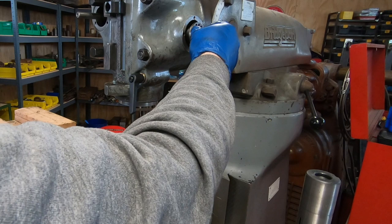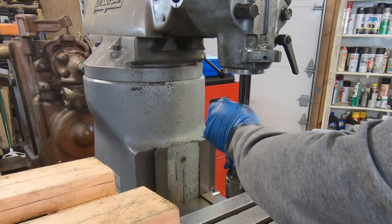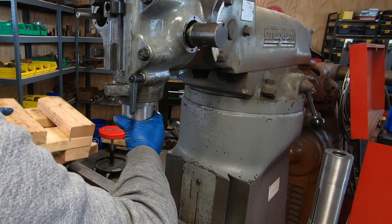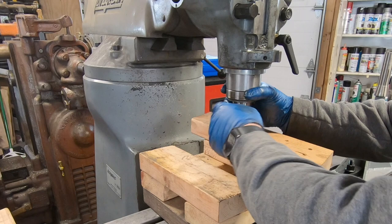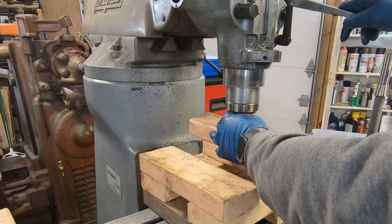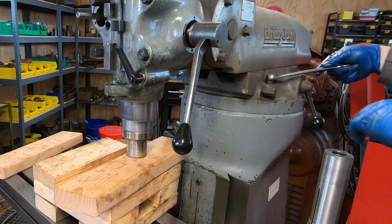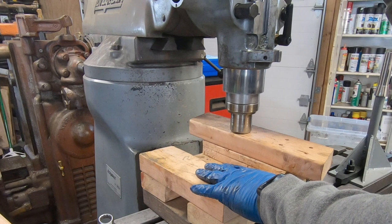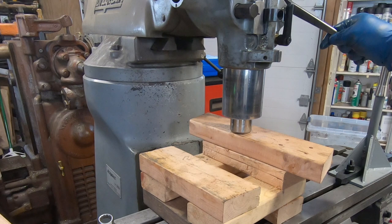Plan B kind of sucked because it meant I had to hold up that quill housing next to the ram — which I'm glad I hadn't taken apart — and get it bolted and secured. The idea is the same: get the spindle started up into the quill, put some blocking underneath it, pull down on the quill handle, and it'll push it right up into the quill. Of course it matters that the turret bolts are tightened all the way. And with everything secured and tightened down, pulling down the handle pushed that spindle right up inside the quill and seated it rather nicely.